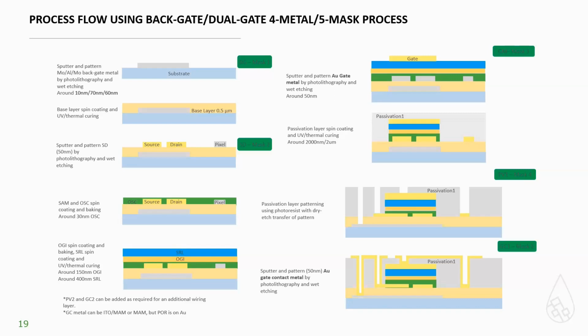Everything we try and do in Smartkem is with the hope of being scalable. So we look at scalability of the materials and transferability. Again, that second dielectric layer enables you to directly sputter a gate metal on top. So you can see we've got a gold gate metal on top now, which we can then pattern and etch and add some passivation on top, as you can see on the picture there. And then all we've got to do is via etch down and realize our metal interconnect.